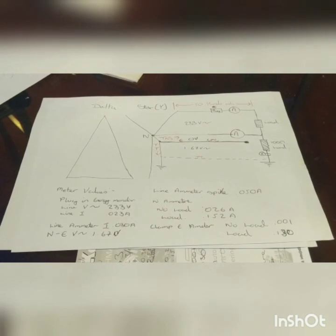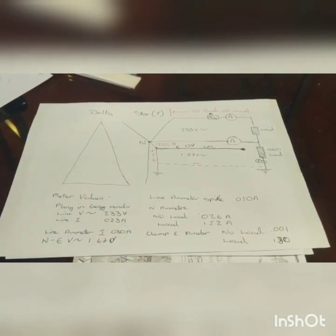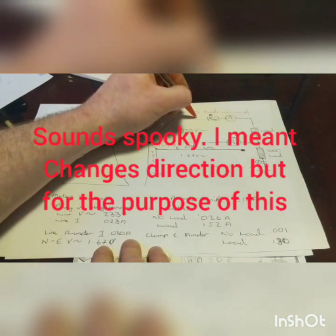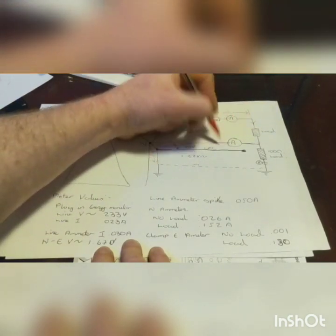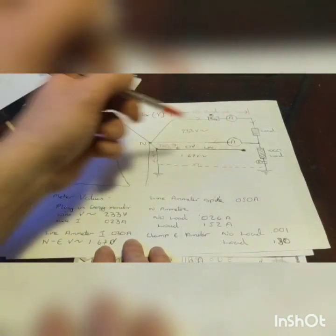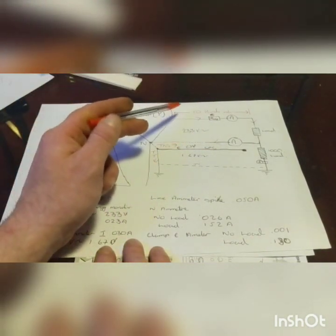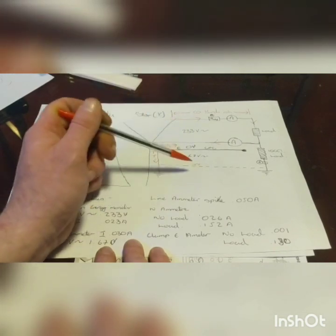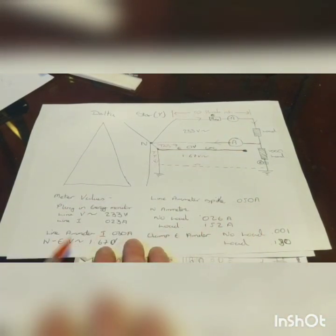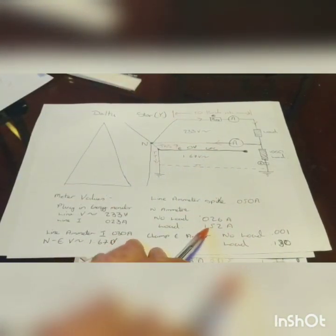I said I'd give my best explanation of what I thought was going on — I'm hoping you can shed some light on it. We all know AC runs in different ways, but we're going to go with conventional flow: it's flowing through the load, through the neutral, and back to the start point in the transformer. The bit that gets tricky is, as I've shown in the demonstration, the live ammeter readings don't raise whatsoever, but shockingly the neutral raises to coincide with what's going through the earth.